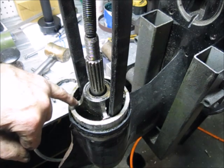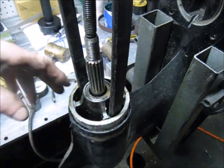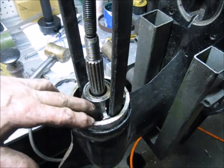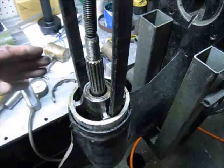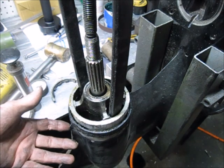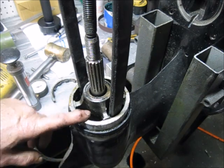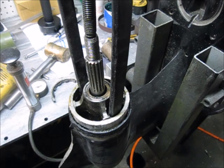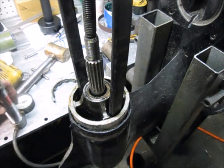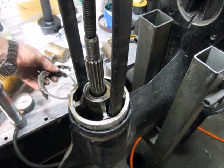Quite often you have to break this area here by drilling and actually break the bearing carrier on the outside, then push the shaft sideways from side to side and put 60 to 80 pounds of air in behind it in the case just to pop it out. That would be one that was really, really corroded - your worst scenario. Nevertheless, it takes a bit of work to take these out.